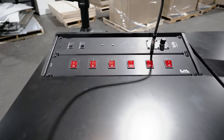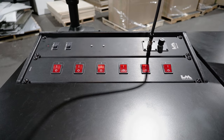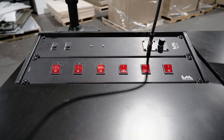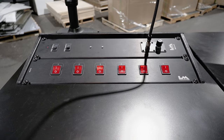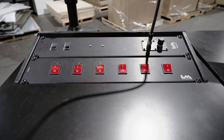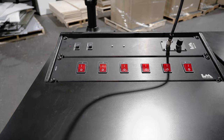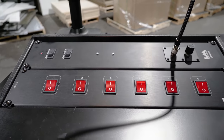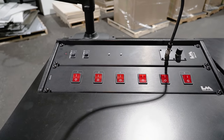One of the most prominent features here is our control panels. This is a unique request from the customer — they wanted to have six outlets that were independently switched. So if a stage manager during rehearsals needs to control lighting, either stage lights or work lights around the theater, they can with this central control panel. The top control panel has six switches labeled one through six, and then on the bottom portion of the rack is just another outlet bank.